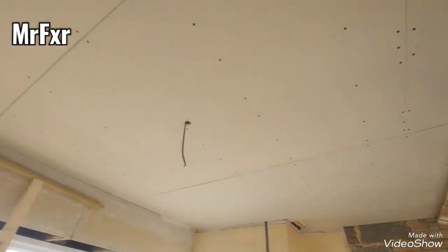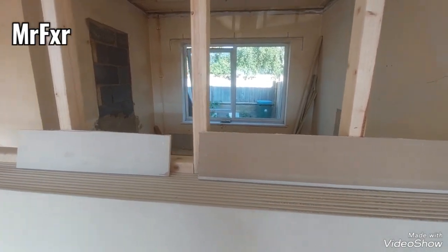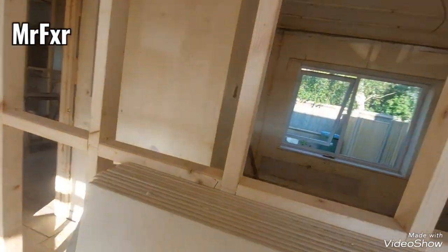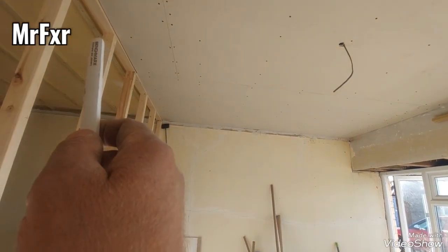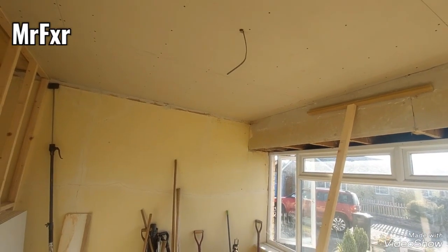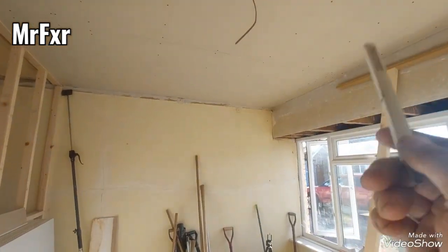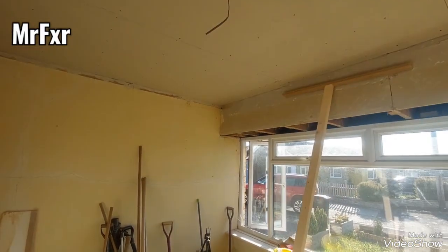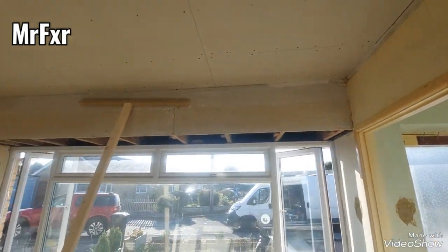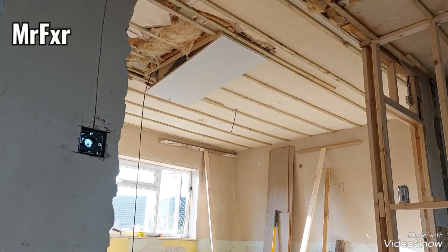And this is pretty much one room done, and this is the wastage I have. I could get stubborn and just use that and fit it in there, and then I'll have even less wastage in one room. That's what I was talking about earlier, just starting with a full sheet, don't cut it, put a piece of wood on a joint. So basically, instead of bringing the joint to the wood, you bring the wood to the joint of the plasterboard, and that's so easy, so easy, and zero wastage as well. So there you go, guys. I'm going to now carry on in other rooms.